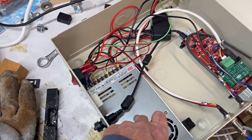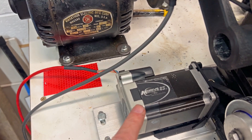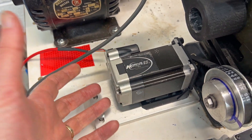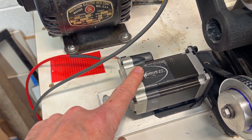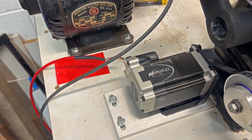What we're looking at here is a 48-volt power supply for an M Drive 23 motor. This M Drive 23 motor is an integrated driver-motor assembly. I have it configured right now at eight micro steps, so that is 200 steps per revolution at eight micro steps.